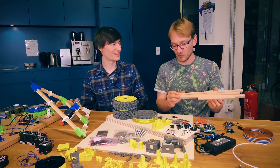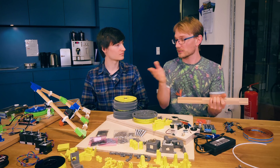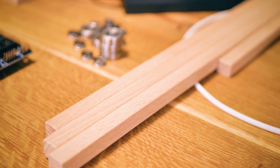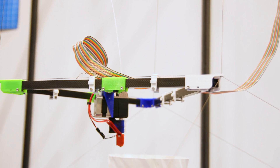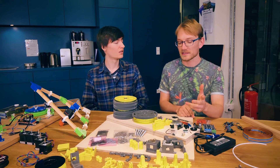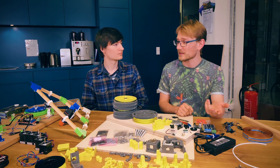You can use any wood you want. We have 13mm here and the other build uses 15mm. You have some other options for materials as well — carbon fiber tubes that are most often used in quadcopters, aluminum tubes, anything with the right dimensions. As long as it's relatively light and relatively rigid, you could use pretty much anything. Carbon fiber is still the favorite — it looks the best and it's the stiffest per gram.